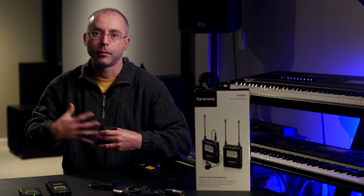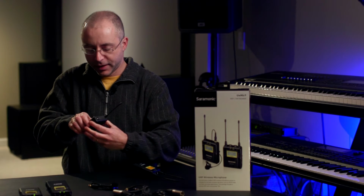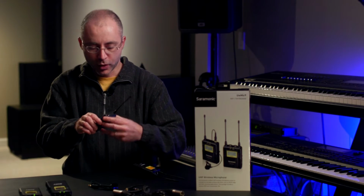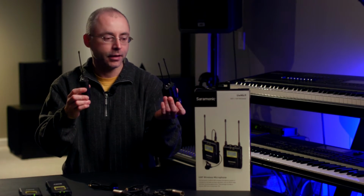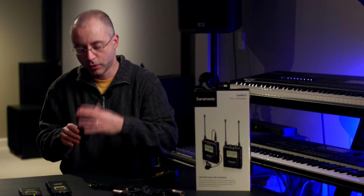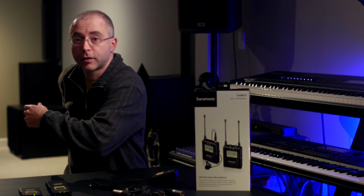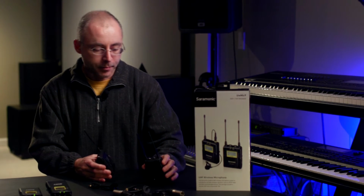There's a lot of liquid, blood and water, so it facilitates audio dropouts on these units. So when you put the receiver in a clean line of sight, it's less likely to drop out the audio. But when you start putting it inside people's jackets and stuff, you're blocking the antenna somehow, especially when they turn around and the receiver and the transmitter don't see each other anymore. So it's easy to explain.